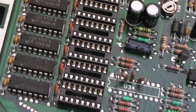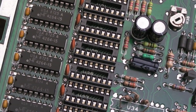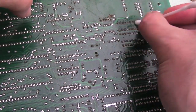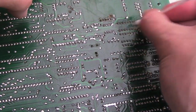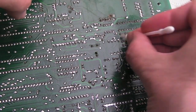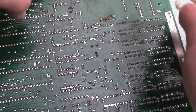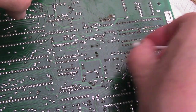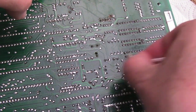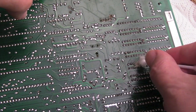All eight sockets on there, and all eight bypass caps — that's 0.1 microfarads, 100 nanofarads. I couldn't get exactly the same type as the originals, but the disc-based ones are fine for something like this. Now my favourite bit: cleaning up with cotton buds and IPA. Lint-free cotton swabs — that's your best bet. I'll pour some IPA, pour it over there, then brush it down. The final thing is just to inspect with a magnifier to make sure you've not got any shorts and that the solder points look alright. It's really mucky — just covered in flux — but by the time I'm done it should be good as new.